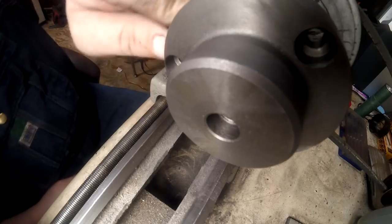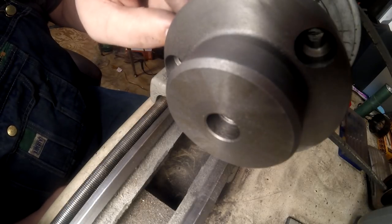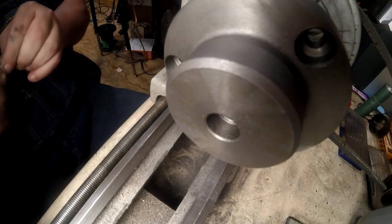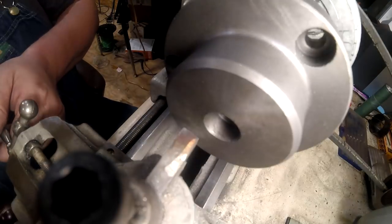And so, then yes, I did take the backing plate back off of the chuck and put it back on and run through and touch it back up. And I got the chuck body running less than 0.5 thousandths run out. That's a four-jaw chuck, so you can indicate the part in perfectly. So you don't have to worry about that.